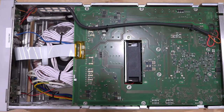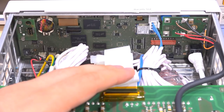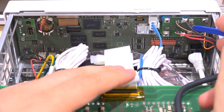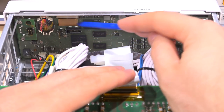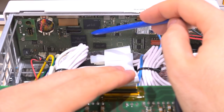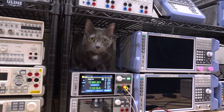Really I'm nitpicking because I couldn't find much else I didn't like. Most complex functions are in a separate analog high-performance board. In the front panel you can see the main output and sense port connectors, a wireless module, main application processor, flash memories, LCD connection, and a real-time clock battery — basically a full computer. There's an unpopulated connector, likely for an additional module common across many instruments in this line.